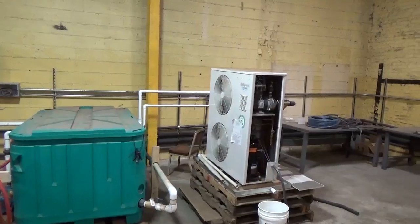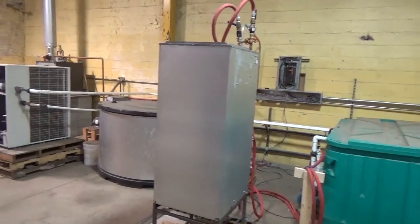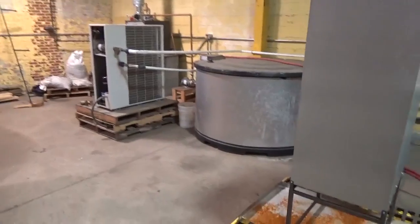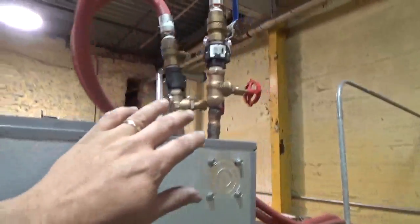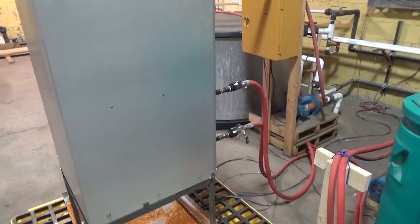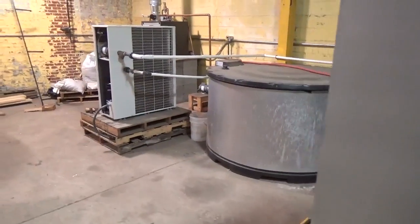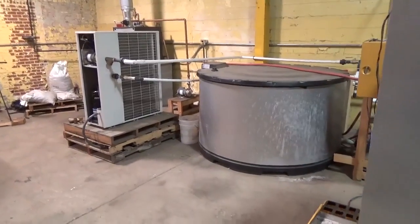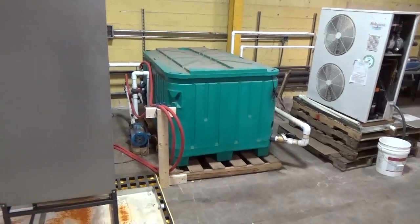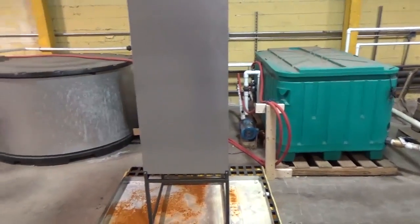It's getting its ETL listed mark, which means the unit has been independently tested and the standards have been published. Here I'm showing you the setup — there's an air handler in the center, a chill tank, and a hot water tank. This is simulating the load of a home or hotel, running hot and cold simultaneously. These units can also be stacked. I think the five-ton unit can handle most homes comfortably — and five tons can be more efficient than seven to eight tons of regular heat pumps because of how this thing is zoned.